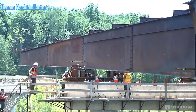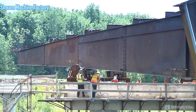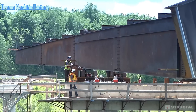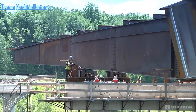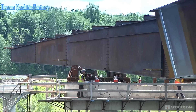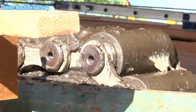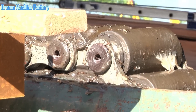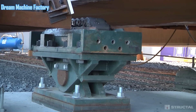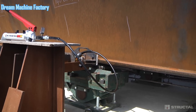By minimizing the forces acting on the structure during the launch, the nose ensures that the steel girders remain stable and aligned. At the rear of the bridge assembly, counterweights are installed to balance the structure and control the rolling moment — the tendency of the structure to rotate. The rolling moment is critical to manage because, without proper balance, the assembly could tip or become unstable during the launching process. The counterweights ensure that the forces are evenly distributed between the front and rear of the structure.